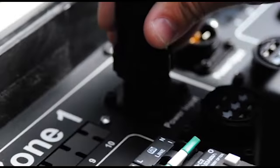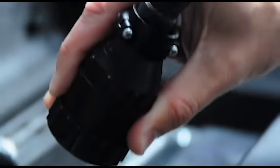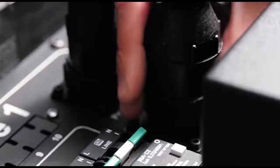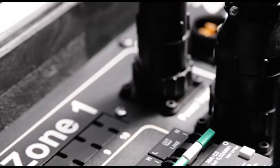To start the ACR3 Hotbonder, first plug in the input power cord into Zone 1. Next, plug the output power cord into the Zone 1 output receptacle. Each connector is keyed and locks for a safe and secure fit.